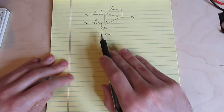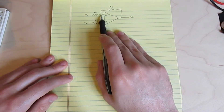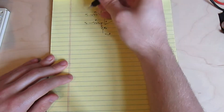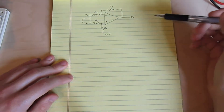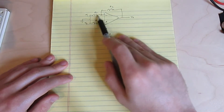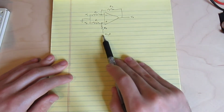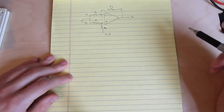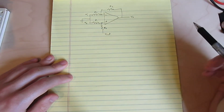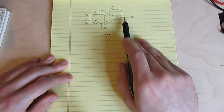Let's start by thinking about what my DC offset correction at Vref actually does. Op amps will adjust their output voltage until the voltages at the two inputs are equal to each other. So if we tied V1 and V2 together and tied those to ground, the op amp is going to want to make V minus and V plus the same, and these two resistor dividers are the same. The only way the op amp can do that is if it makes the output voltage equal to Vref. This whole circuit is a differential amplifier, which amplifies the difference between V1 and V2. So when we have zero difference, we want a zero at the output, and the voltage it gives at the output in that case is Vref. So basically Vref tells the op amp circuit what zero volts is.